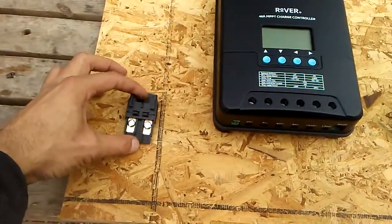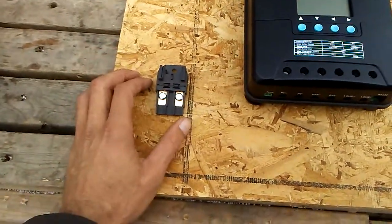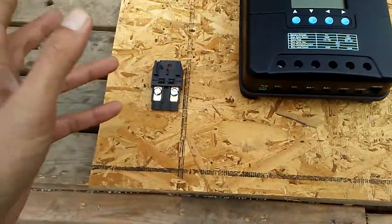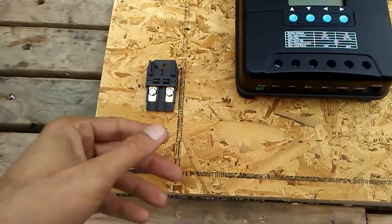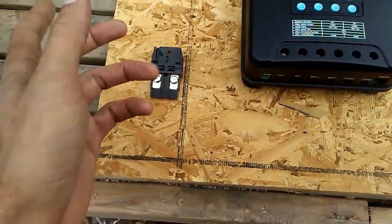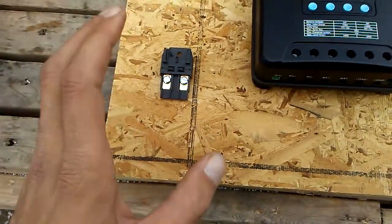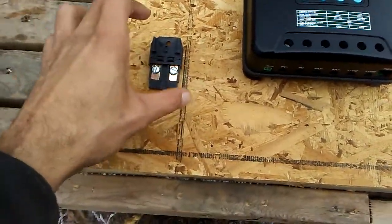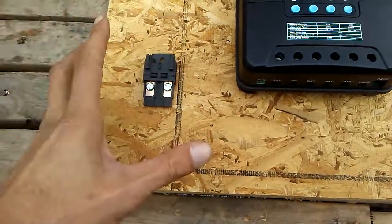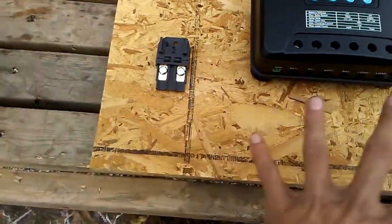These are the fuses. We were gonna get breakers — you have to get a DC breaker and then an AC breaker. The arc is a little different when they trip out, so that's why they're different. You cannot use an AC breaker; there is an AC and a DC one, but it's mostly based on DC current. Still, you have to use a DC breaker. I'm gonna get one of those when I get my power shack, but in the meantime I just got these 40-amp fuses. I'll put those in and show you guys how to do all that.